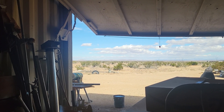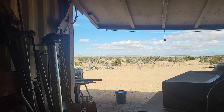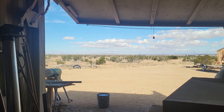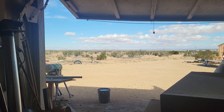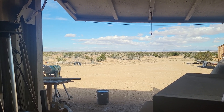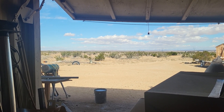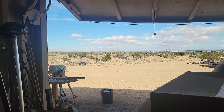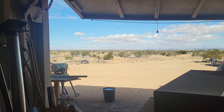But since I've played around with dirt batteries before, I've got to give this a try and see for sure. So let me explain what he did first. He took a plastic container, like an old coffee grounds container, and he put dirt in it — or sand, or whatever — and then put a little bit of crushed wood charcoal on the top of that. Then he made two electrodes: one out of a piece of half-inch copper pipe, and the other one he used a galvanized piece of all-thread. So those were his electrodes sitting down inside.